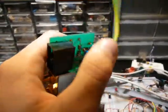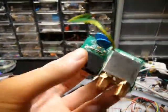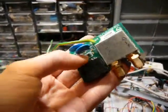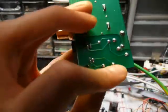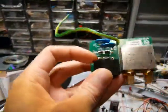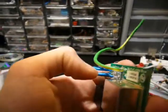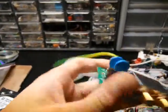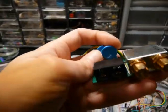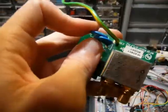Incidentally, these MOVs are used inside of things like multimeters as well, for similar reasons, and actually a very similar circuit. So if you have too high of a voltage on your multimeter, these will blow and protect your meter. Oftentimes these fuses won't blow fast enough, and these MOVs will actually explode. So you'll often see them covered with some heat shrink, just to limit some of the damage caused by exploding MOVs.